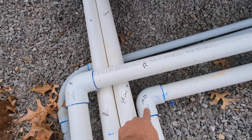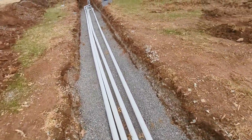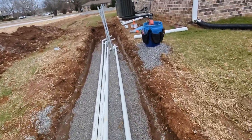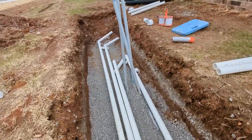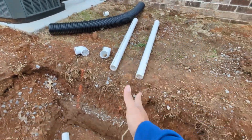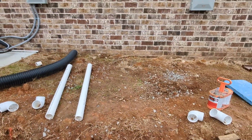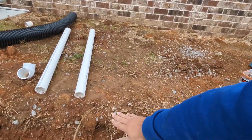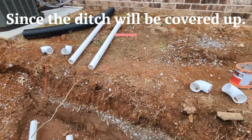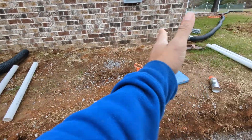Return, skimmer, main drain — marking them will also help anybody else coming in after you to continue any plumbing, or the people that will come to inspect the ditch and the pool work. There are vertical pipes that come up here to the pad that is not yet built — also mark them at ground level, so you know which pipe is what when it comes to plumbing at the end of the day.